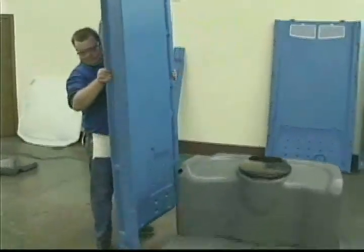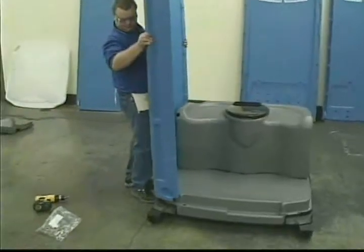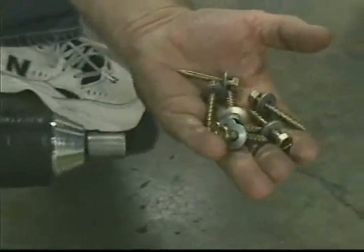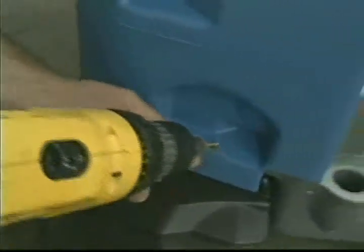Get a left panel and place on base, and insert the protrusion on the inside of the panel into the pocket of the front of the base. Place the panel firmly against the base with one foot and install two leg screws vertically into the two dimples in the left front pocket.